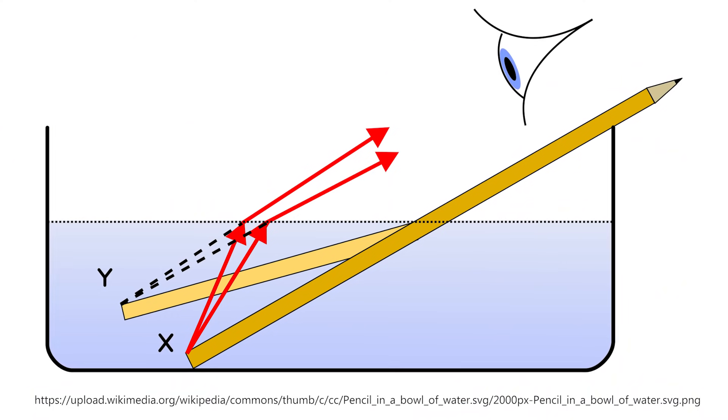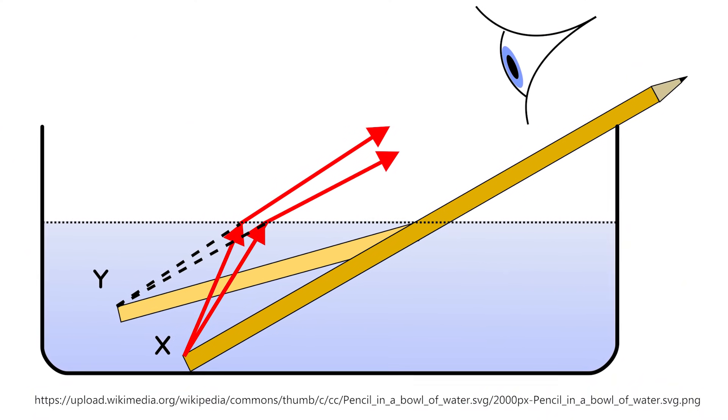But it's not all so simple. Anyone who's looked at a straw from the edge of a glass filled with water will know that the refractive index of a material greatly affects the speed at which light travels through it. And this is bad if you're trying to precisely focus a laser through a material at a specific point. So the crystal used is specially selected — although you can use clear plastics, it's just not as effective. The material also needs to be of very high optical clarity, something similar to what will be used in a lens, for example, such as Schott BK7 or Chinese K9 borosilicate glass. Crystal is usually specified.